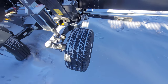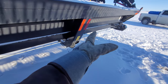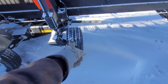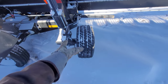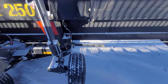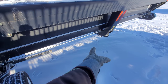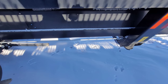Con number three is the gauge wheels. These wheels are far too small — they need to be full size, which I think is now an option. They also need to be positioned farther out, closer to the end, because you've got too much header hanging off the back of these wheels. If you're in rolling ground, you're going to smack the header into a hill before the gauge wheel starts signaling the combine to lift the feeder house. They probably put them at the main support brace, but I think they need to be moved out farther.